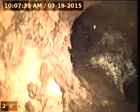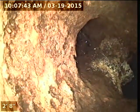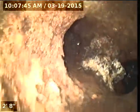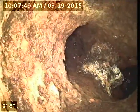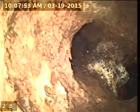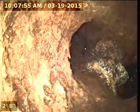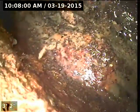As we're going in, we can see this is basically a two-way cast iron clean-out, allowing you to go to the downstream. It's got a bridge in the middle, allowing you to go toward the home. This one is currently rusted out. The problem we see with the heavy rust is eventually it will start to catch toilet paper and clog up the line right here in the clean-out. So we're going to head to the downstream and see what material we have.